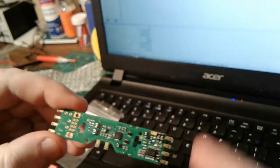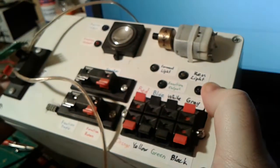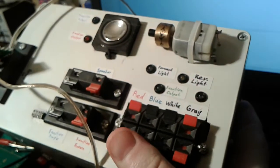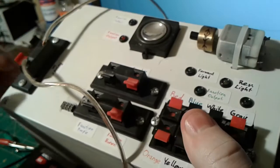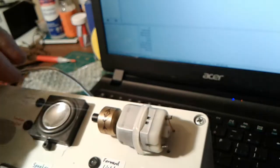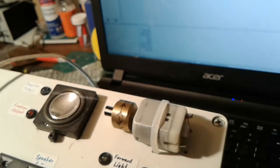Now, I would normally use my homemade decoder tester because of the big contacts that I had put into it. I have a bunch of these homemade gator clip wires, just with pretty heavy gauge speaker wire. But this motor here is drawing a lot of amperage for some reason, and I almost blew a T1 TCS decoder this evening, so we'll put this aside until I replace that motor.